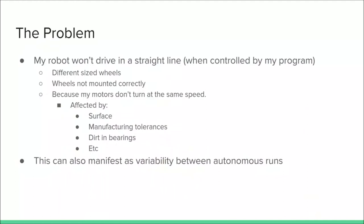So your robot won't drive straight. Why is that? There are a bunch of possible causes. Manufacturing issues are the obvious one — maybe you made the wheels very slightly different sizes, or maybe you didn't mount them straight on the chassis. The other cause is that the motors don't turn at the same speed. Even if you've made everything perfectly, it still won't run in a straight line. That can be down to the surface — carpet, wooden floor, tiles, gravel, or an obstacle course will all cause the motors to run at different speeds. You also get manufacturing tolerance problems where the motors are simply different. And then there's dirt in the bearings, and a particular problem for me at home is hair getting wrapped around the motor shaft.